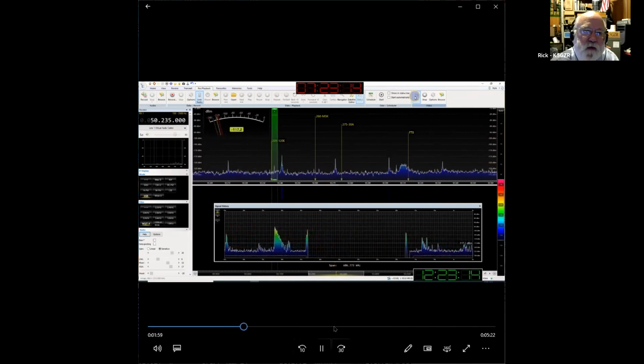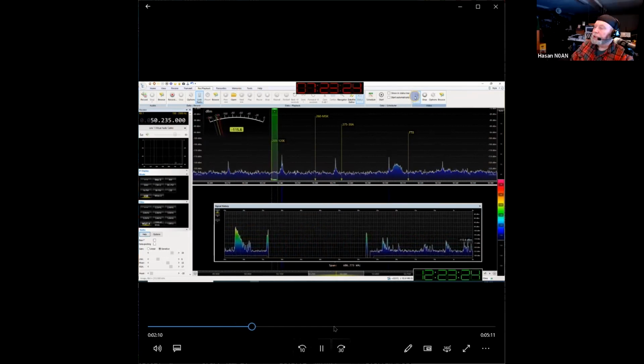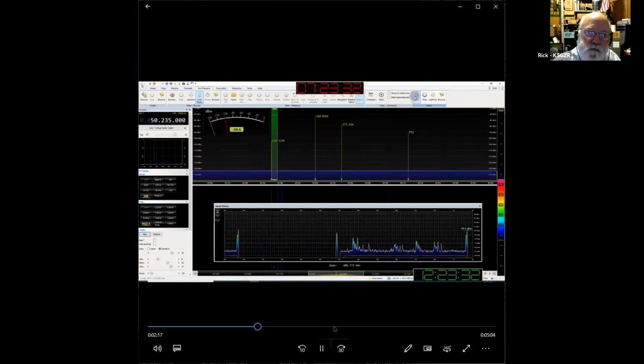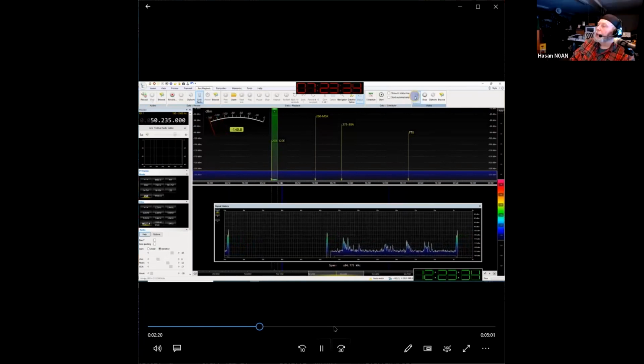While we're waiting, this is a recording of what was seen on the screen. You can also record the IQ and replay it. Yes, this is an MP4. And display the same thing in some other way if you want to, the same received signal. Yes, the IQ recording is more powerful, but it takes more processing time. The MP4 recording is easily shared among people and doesn't require any SDRs, which is a big advantage, so I could share it with you. Let's see here.